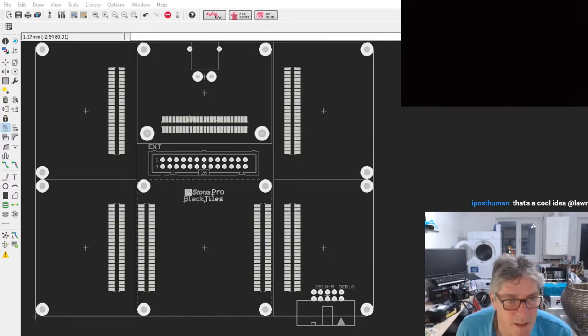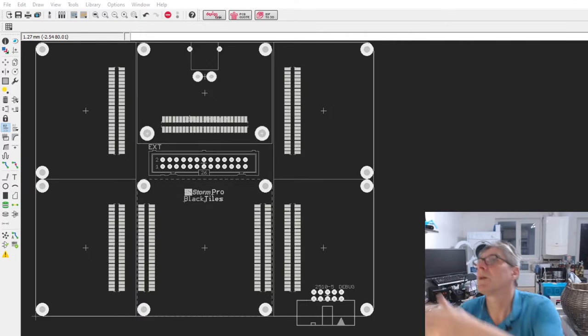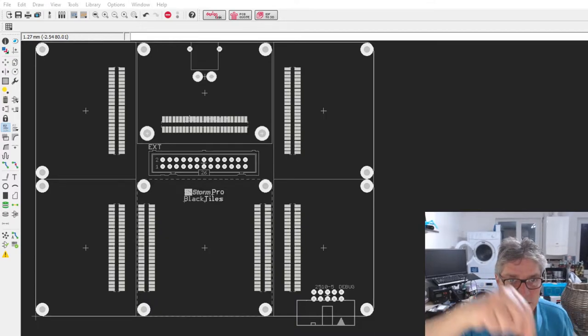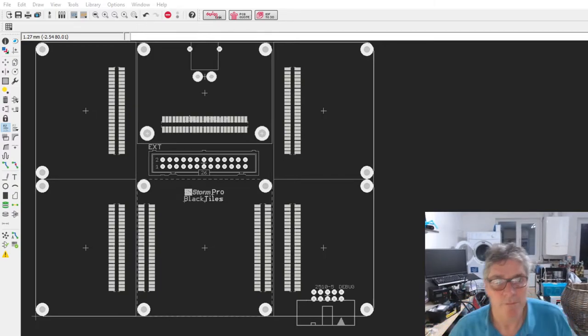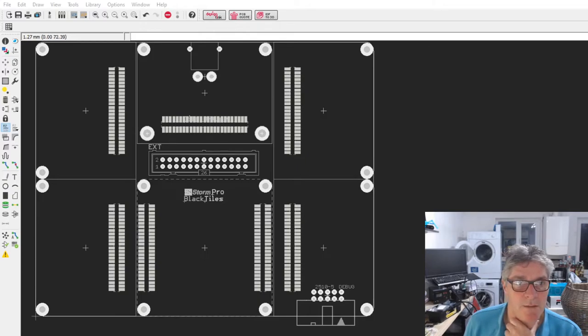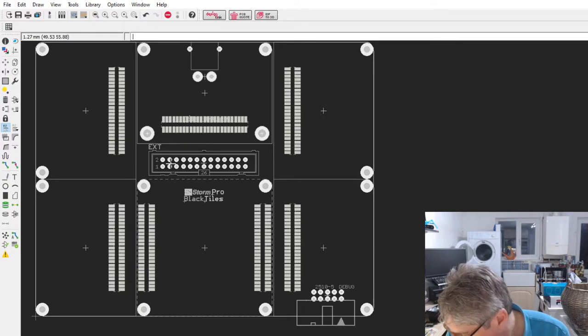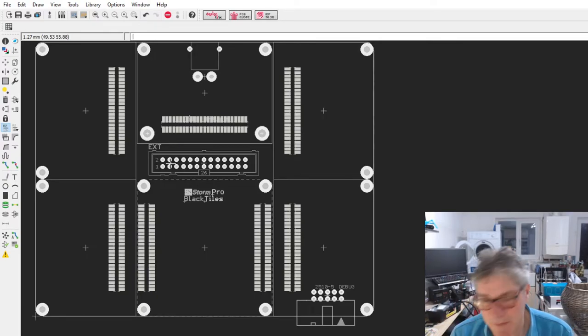Anyhow, so this card changes. I mean, you've seen me use what I normally use when you see me running the other stuff here: I use the PMOD extender in between two things, and then I hook the DuPont cables on and take those to the logic analyzer. But if you do something like this here, with it grounded on one side, that can go to an IDC cable, which can plug directly into a logic analyzer. I mean, you'd need a special cable, because say I'm using the Saleae, my one's only an 8. It's a Pro, but it's only 8.